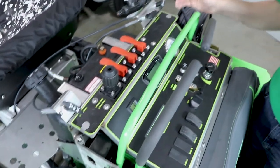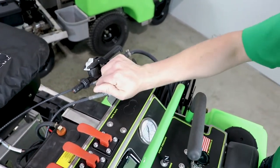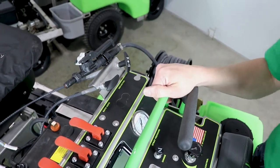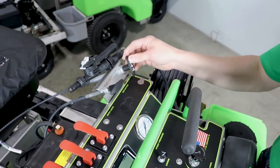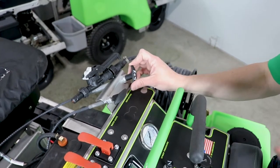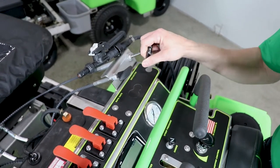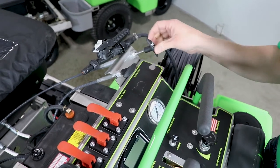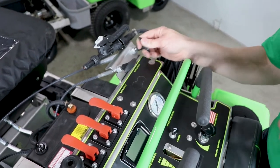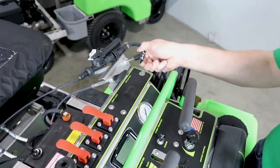On the right side there are two cables. You're going to have your door open and close — the actual gate on the hopper. This one does not lock and does not need to, as you have a setting on the front that handles that. The cable on the far right — the same cable used on the left side, so if you stock one cable you're covered for two replacements — is your side deflector on the left side of the hopper. It locks left and right: in is up, and out is down for that side deflector.